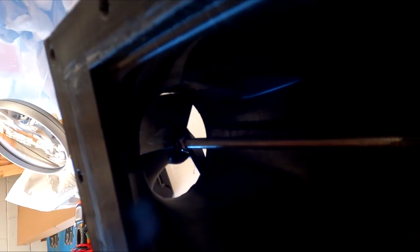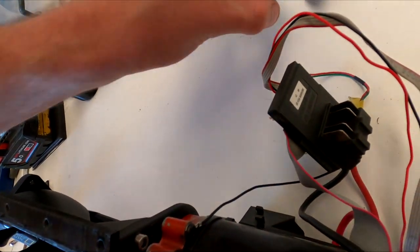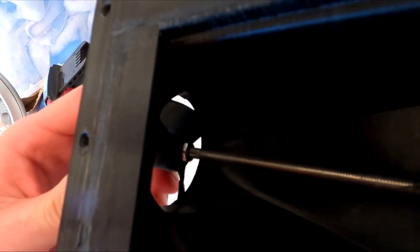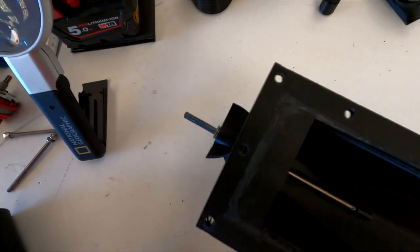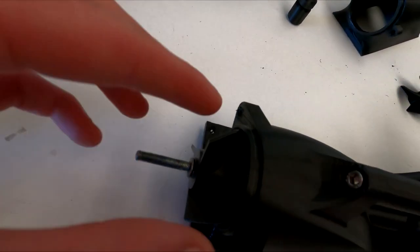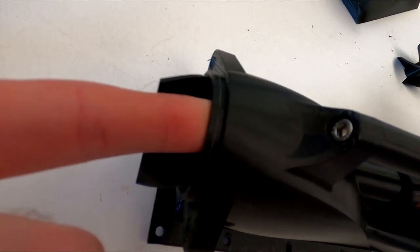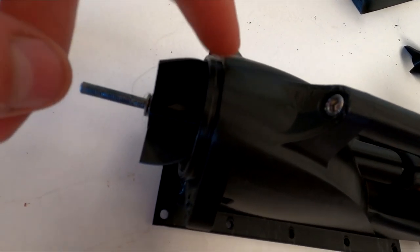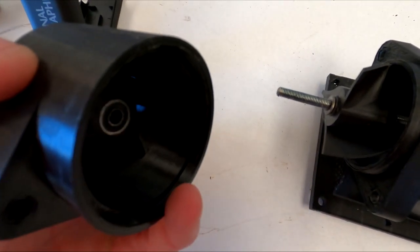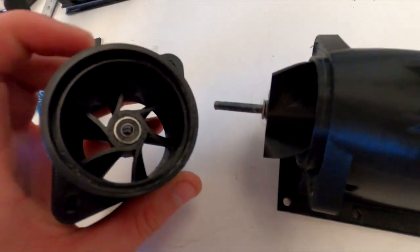Right now, the impeller is just locked with a nut inserted inside of it. It has a hex inside of that impeller, and then it's just locked there on another one. And that's locked at the right depth. The next piece that slides on after it, another key feature real quick, is actually how this is set up. So the inside follows on further than the outside. And then same with the corresponding part, it's the opposite. The inside carries forward and locks into this. I just got to line it up there.